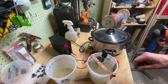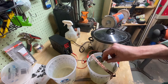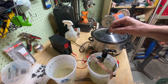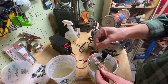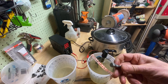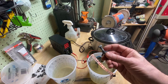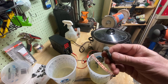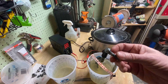We've been in there for about six or seven minutes. I'm going to pull the part out. You'll see people say to shut your power off or break the circuit with a button — you don't have to do that. You take the piece out and it breaks the circuit anyway. I'm going to run it in a little distilled water here and then let's take a look. Out of the tank: the head looks fine, plated with zinc. There are a couple of darker spots and darker on the threads, but the whole thing has been zinc plated.